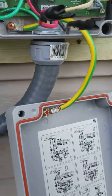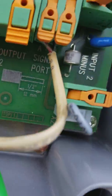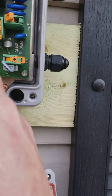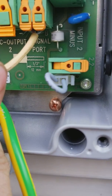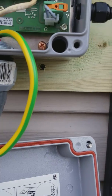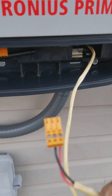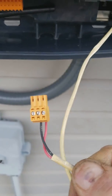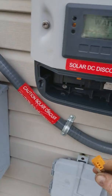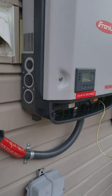The black wire is just a common ground. Signal A goes to N.O. and Signal B is the common — that's the black wire. So A is hot on N.O., and B is a ground. The center wire originally we hooked up to the NC pin and we couldn't get the inverter to work, so it took lots of reading and getting another guy to help.